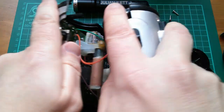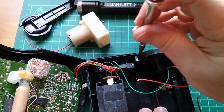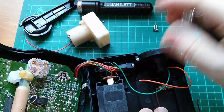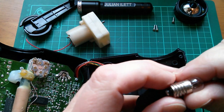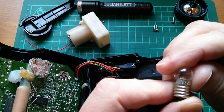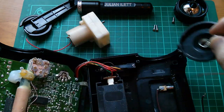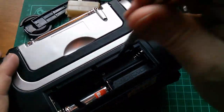I need to get this open really. That's done it. Let's take the lamp off. This is the presumably three-volt incandescent bulb lamp. Yeah, it's a standard miniature Edison screw MES bulb — 3.6 volts, 0.3 amps. Horrid little thing.